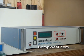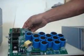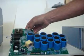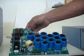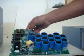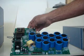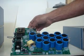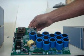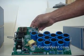The standard D-Fib-5 uses a bank of 13 electrolytic capacitors to comprise the 32 microfarad capacitor bank. The advantage of these capacitors is their small size with respect to the amount of capacitance offered. We can supply the 32 microfarad capacitance in a very small 3U package, as you have just seen. We mix and match these capacitors to provide a bank within the accuracy tolerance of 5%, as required by IEC 60601-1 Issue 3.